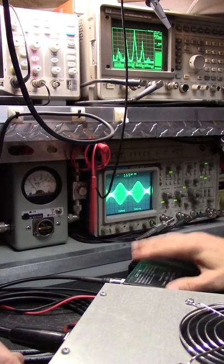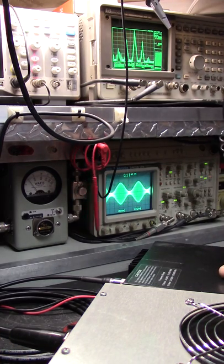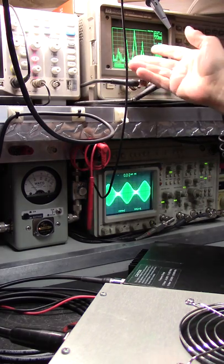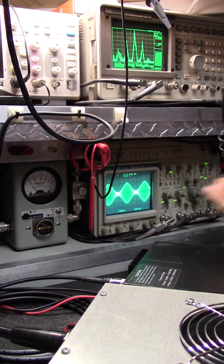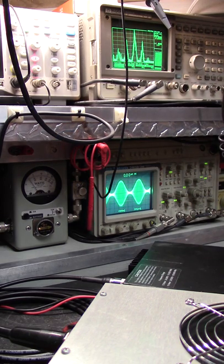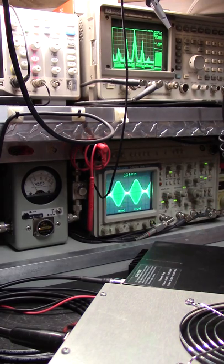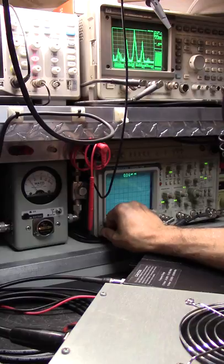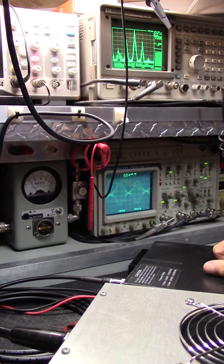Even though this guy builds these for what he calls RMS watts. There's nothing there. Just a massive amount of distortion, spurious emissions and harmonics. And again, once you pinch the negative peaks, okay, power's all gone. See it there? See the line? That's not a line there. It looks that bright though in the camera. Let's see if I can get it in there. But it's useless. Totally useless garbage.